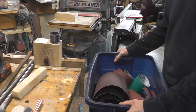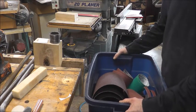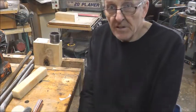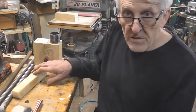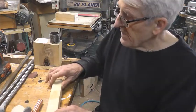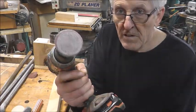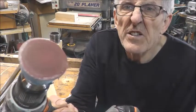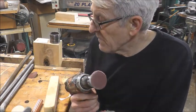The regular thin sandpaper will tear and you wreck it on sharp edges, but put a piece of this on your vibrating sander and you can sand over edges and all sorts of things. If you have a belt sander or a disc sander, this is the type of paper that's going to be on there anyway — it's not paper, it's actually cloth, super strong. You probably have one of these sticks for cleaning those belts and discs. Put this one on the drill and it's got all kinds of stuff on it, but pretty soon it's back to where it's new and you just keep going. It'll outlast the regular expensive paper discs that are velcro-backed.